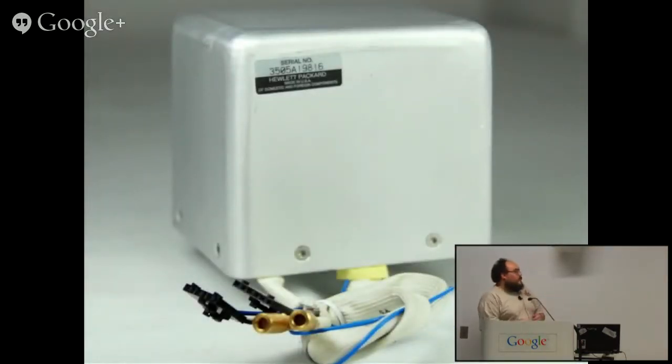So yeah, then we come back to crystal oscillators. The very best made crystal oscillators are about 0.1 parts per billion drift. You're well under the second per year category here. That's the HP 10811, which is essentially if you bought nice HP or Agilent equipment, or in fact several other vendors over the last 30 years, maybe not in the last 10, and specified the high quality oscillator option, you got one of those. And in terms of widely available crystal oscillators, they are one of the best commercially available.